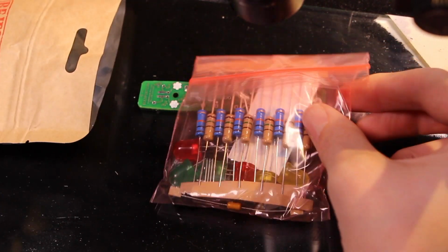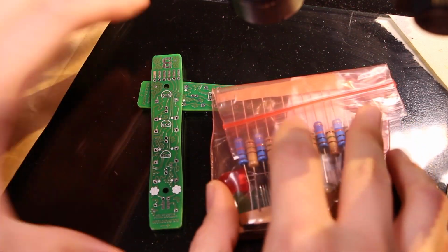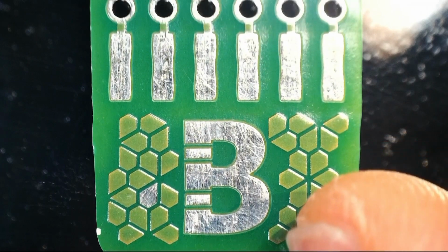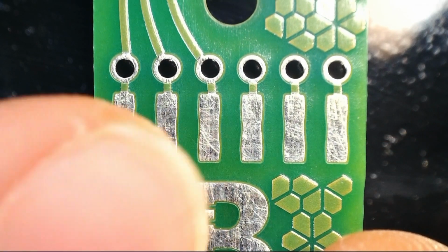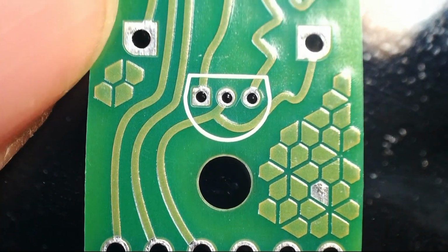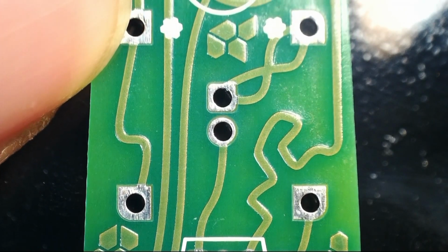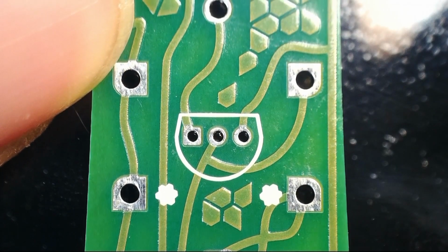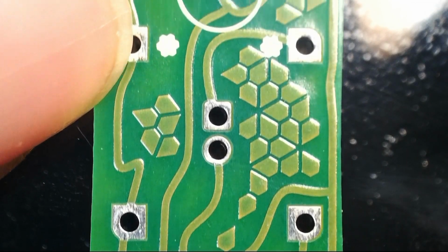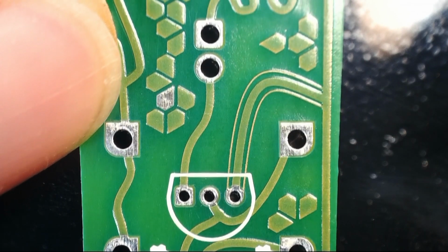So we've got some of these beautiful resistors. So we have these two boards, which look similar. Yeah, it looks like they're the same. So part of why these boards look so interesting is he designs these using his own software that lets him do all of the work in illustration tools like Inkscape instead of using traditional PCB design software. So he can just draw these traces using vector software, but he still has a Python script that handles the kind of manufacturing details like the spacing between the solder mask and the pads and the clearance around the holes and things like that. Oh man, that trace is great.